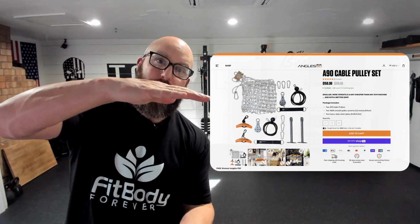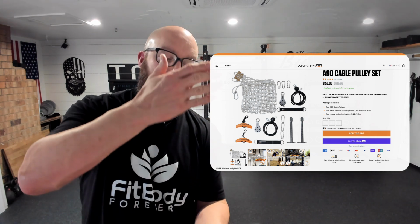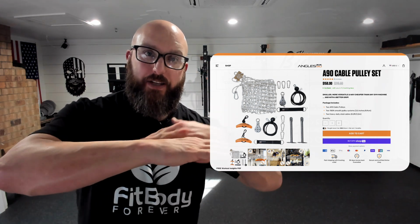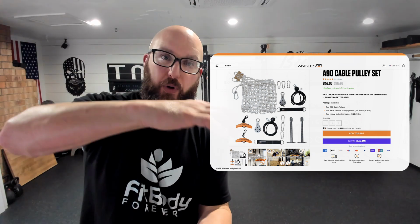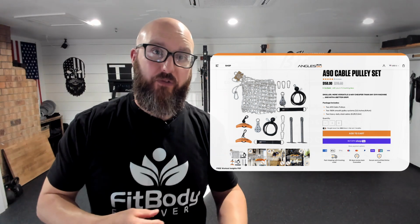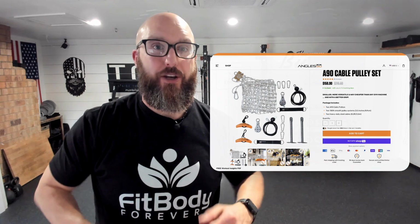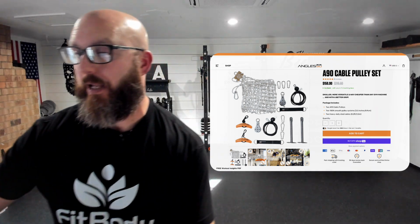Mine is on an 18-inch, one huge bolt that goes up, and I have two 4x4s in the ceiling that are stacked side by side, and then two more on top of that, and then we have a bracket through the center, and then it's bolted together. Like myself, I'm 250, John is like 270. We both stood and hung on this thing to make sure it wasn't going anywhere, it didn't budge. So you want to secure it, make sure this thing's not going to go anywhere, okay?